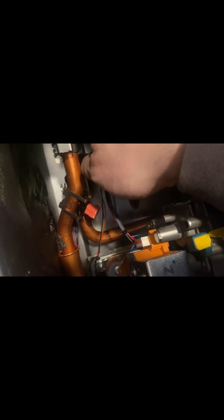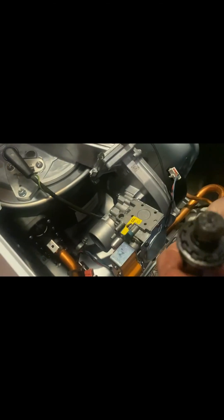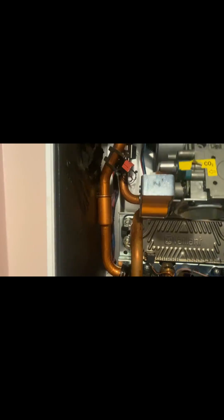Just be a bit gentle, you don't want to break anything, and you're just also making sure there is no excess water in there, which there isn't here. What tends to happen is a bit of crud. That sensor just monitors water pressure, obviously. So when it kicks in for heating, it expects to see a rise in pressure of about 0.2 bar. If it's not getting it, it could be a dodgy pump, but it could also be the actual sensor that's monitoring it. Crud in the housing, like we say, which just blocks up the sensor.